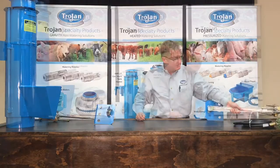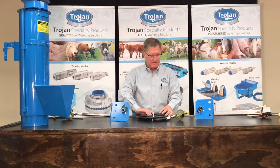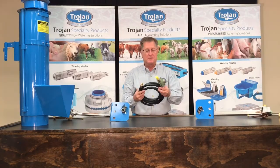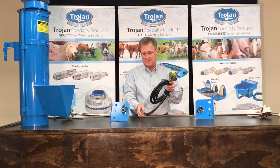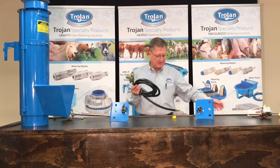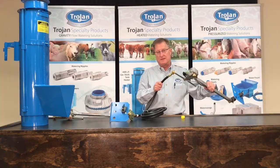Also this year, which is going to be new, each and every one of them are going to come with a propane hookup kit. It's going to have a 10-foot hose, what we call a 13WC pressure regulator, with all the fittings that you need to hook it up. This will go into your LP gas tank and this other end of the propane hookup kit hooks into what we call the inlet fitting.